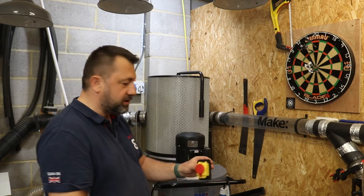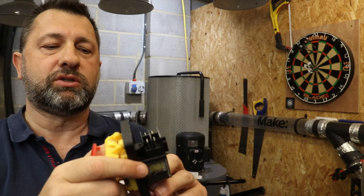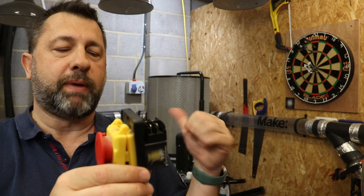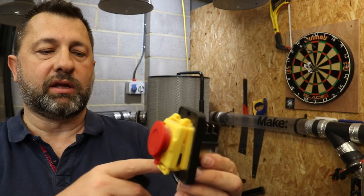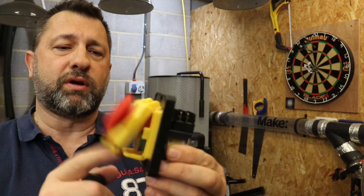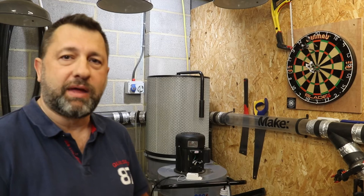What I've had to do is remove the power switch, because the power switch is magnetic — when there's power to it, it can engage and will stay engaged, but when you switch the power off it automatically cuts off. The problem with that is I could put the power on via the wireless Quintek thing, hit the fob, the power's on, but then I have to come back here and engage it again every time I turn it off.